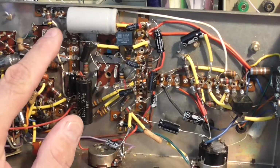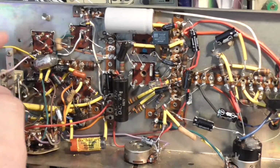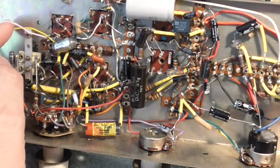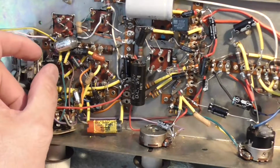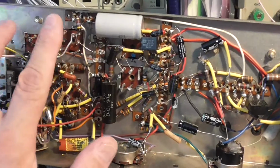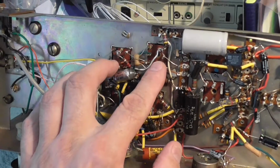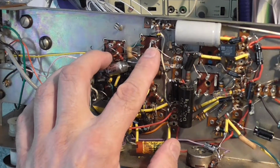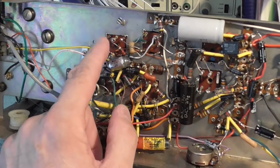So recap, you've got this resistor here to replace, this one here to replace, that wire there to replace. It's got a melt point on there with a soldering line. See these two, I think these two IF cans, this is the bottom of them here, are to do with the VHF FM, whatever. So I think replacing them two resistors might help.